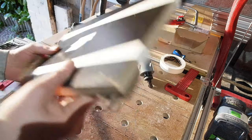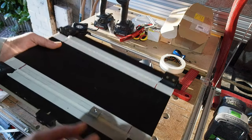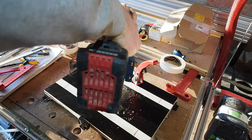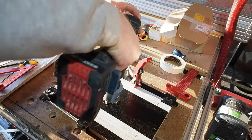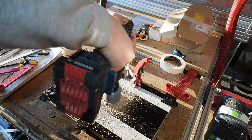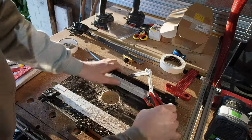Here I've marked out for an 8mm slot on top and a 20mm slot on the bottom — these will house large sliding T-nuts for the profile. Before I get on to routing those out, I'm cutting a 60mm hole in the center. Bit of an afterthought — it'll give me something to grab hold of when removing the thing from the box when it's all done.